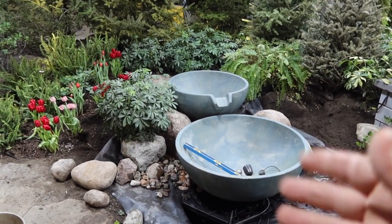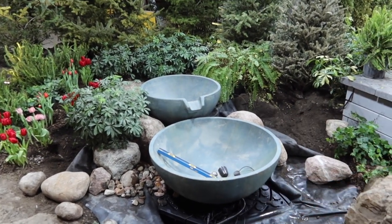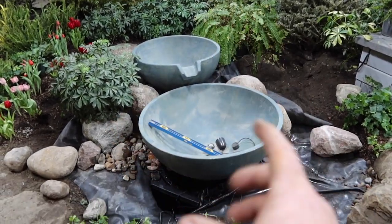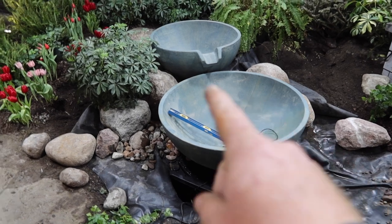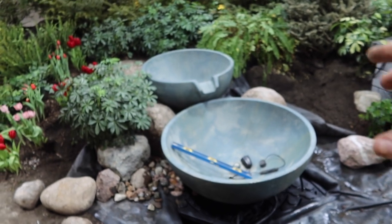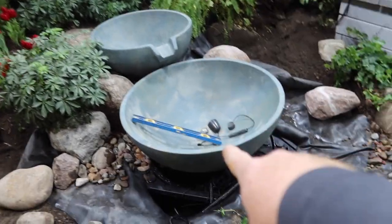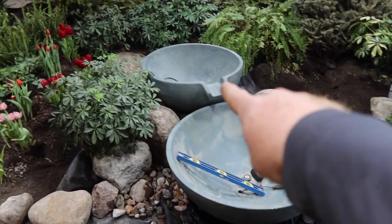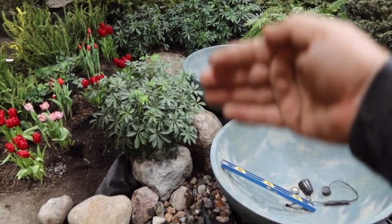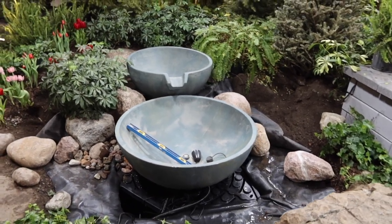The other thing we're playing around with is the necessity of this bib liner. The purpose of a bib liner on other projects — whether it was the stacked urn, the sphere, or the basalt columns — was really to catch the splash. On this one it's not so much to catch splash since everything is confined to the bowls, but there are opportunities for water to drip back down along the base, and a plumbing leak on one of them would have been outside the liner. So we really wanted to make sure the liner came all the way up and behind that bowl.